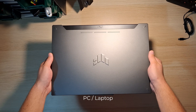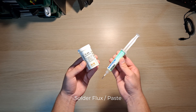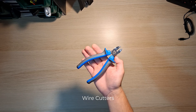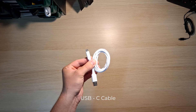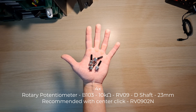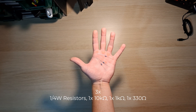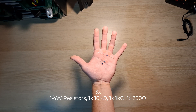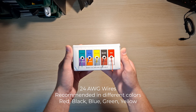Let's prepare tools and parts. You'll need safety goggles, a PC or laptop, a 3D printer, soldering iron, solder wire, solder flux or paste, wire strippers, wire cutters, fine-tipped pliers, tweezers, a Phillips screwdriver, a USB-C cable, and glue. From electronic components you'll need 1 Arduino Pro Micro, 8 push buttons, 4 rotary potentiometers, 3 slide potentiometers, 2 rotary encoders, and 3 quarter-watt resistors: 10k ohm, 1k ohm, and 330 ohm, plus wires.